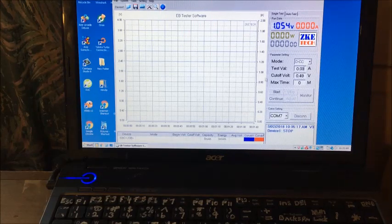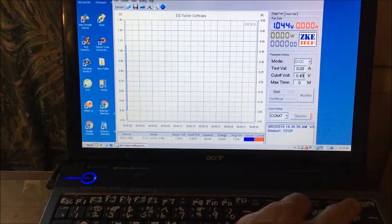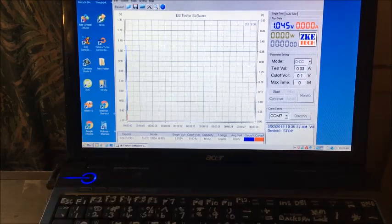I don't think they're connected. Where are we? Oh yeah, we're down to 1 volt after 12 hours. So we'll attempt a 30 milliamp draw on a 12 hour idle cell. Nope, we're dropping right off. I'll change this to 1 volt, 0.1 volt.